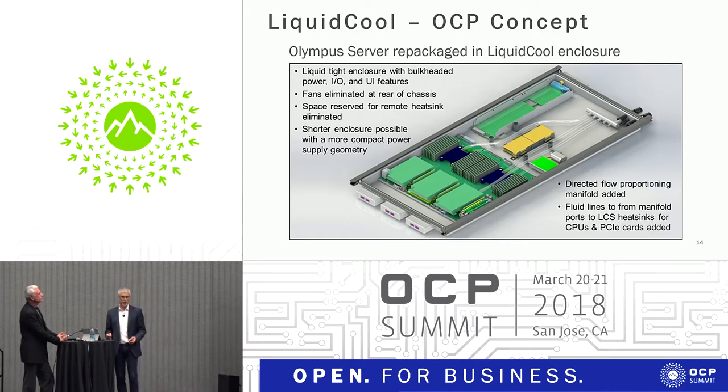If you take that one step further, what we've actually been working on is taking standard industry motherboards and applying fluid to them. If you take that to the extreme case and start thinking about how you could design a motherboard that was only run in fluid, you can come up with really unique capabilities we've not thought about in our industry. I think that's one of the challenges for all of us — to start thinking about what those designs might look like and what kind of densities we could drive, because the thermal carrying capacity of the fluid is so much different than what we can achieve with air today.